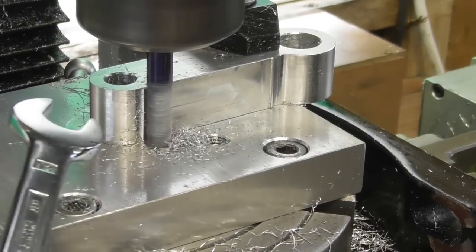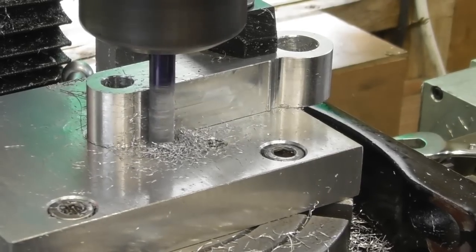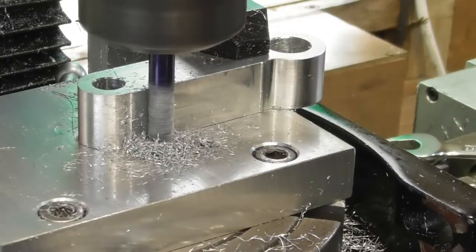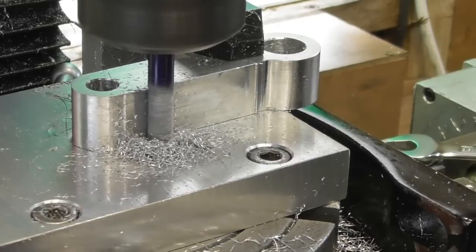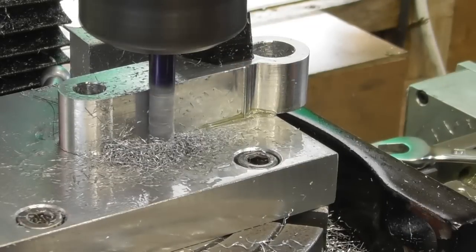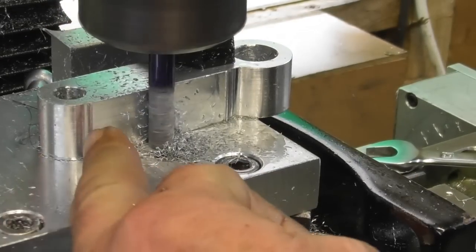So I've got a reference point of where that was, and I'm 0.6 off it. So I'm just going to scoot along here until it stops cutting, which will be somewhere across here, bearing in mind I left a little bit on this space when I machined it before. Speed that up a little. Give it a little bit of WD on the surface. Try and keep this swarf out of the way. So you can see there where I finished the cut.